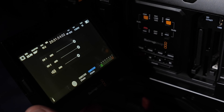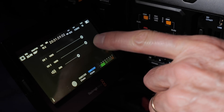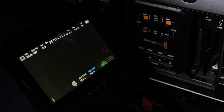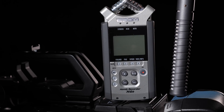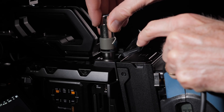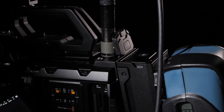Why do you need more gain or amplification? If your recorder doesn't provide a lot of amplification, then for a lot of consumer-grade microphones you may have to turn that input level really close to the max or all the way to the max. When you do that, generally what happens is you're going to get a little bit more self-noise or hiss in your recording, and that doesn't sound great. What the Fethead Phantom does is provide additional amplification so you don't have to push your camera or recorder's preamplifier quite so hard. As a result, you get cleaner recordings with less of that self-noise or hiss.